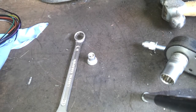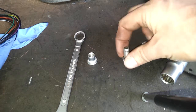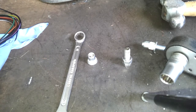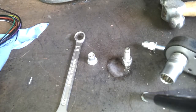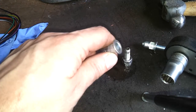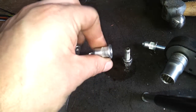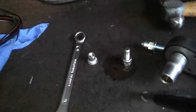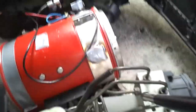We put a 13mm spanner on the inner nut and a 13mm socket on the outside, then just tighten that up — that pulls the back of the nutsert forward and expands it, creating the necessary tension. Just prior to expanding it, give it a little shot of WD-40 — that lets it slip on the flat surface and stops the insert from just spinning as you tension it.